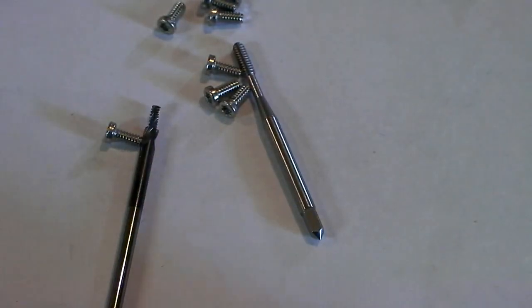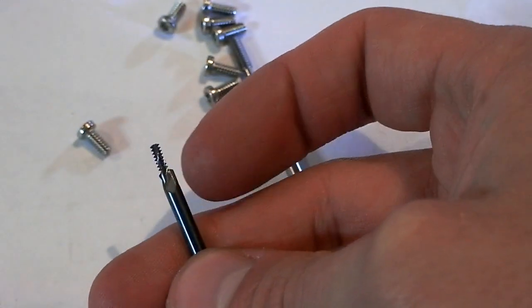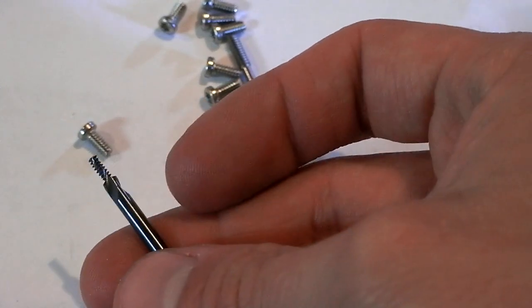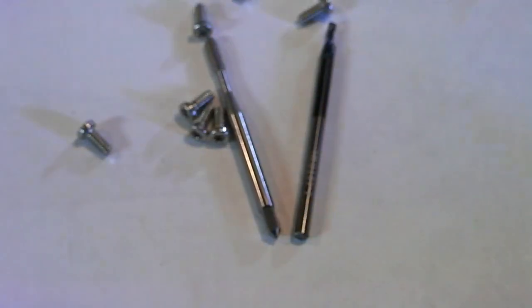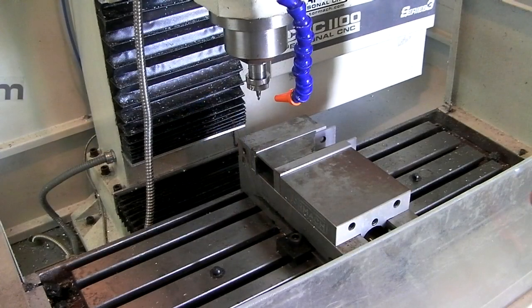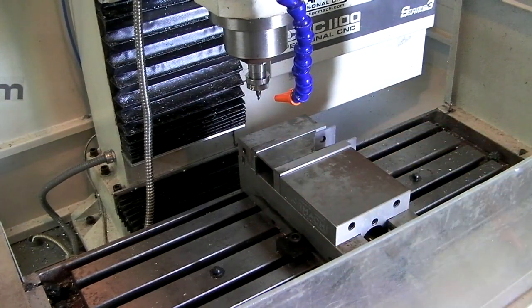So I'm going to use this — rant over. But I am terrified of breaking this thing, because for one it's $50, and I only have the one of them because I didn't want to buy two. But theoretically, if the code works — if you air test it first — then it should be pretty good. The first step is to accurately spot drill all the holes; there are going to be 85 holes. Normally for a jig like this the exact location doesn't matter so much, but since we're thread milling I want the holes to be exactly where I tell them to be without any wandering of the drill bit whatsoever. So we're going to spot drill these — here we go.